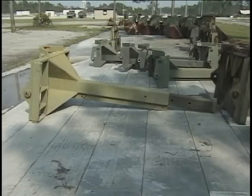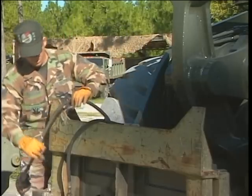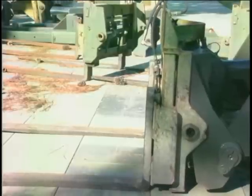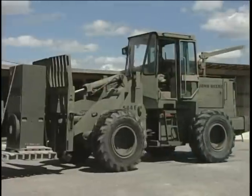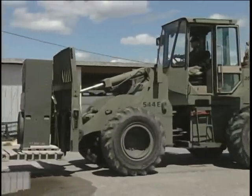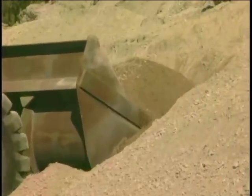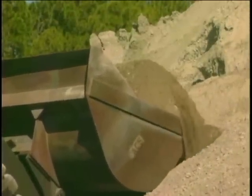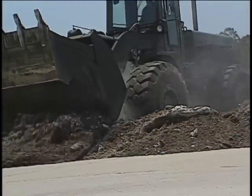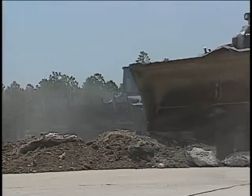and a boom attachment. These attachments can easily be interchanged via a quick coupling system mounted on the front end loader boom assembly. While all the attachments serve a specific purpose, the bucket attachments are by far the main attachments you'll be using in both peacetime day-to-day operations and during contingency operations where rapid runway repair must be performed.